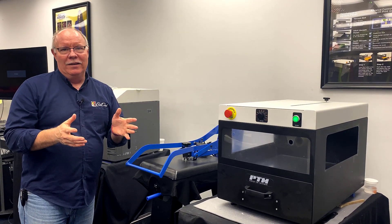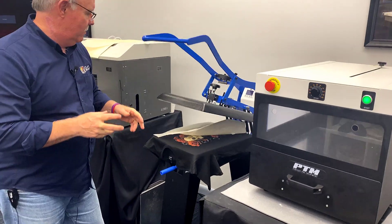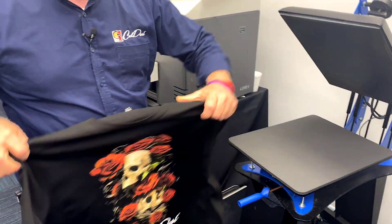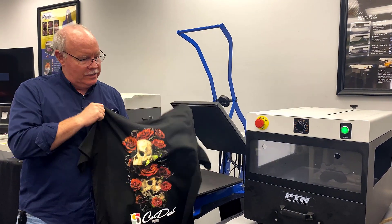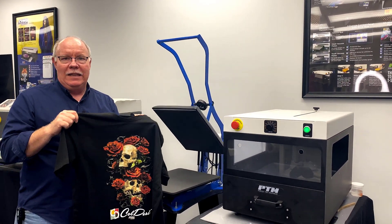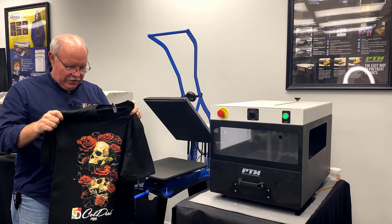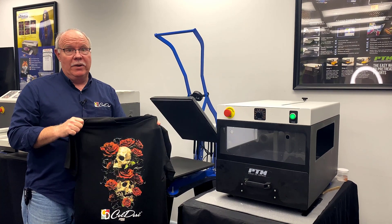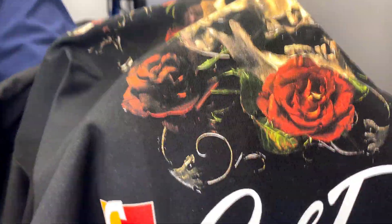DTG has come a long way in the last 16 years since it really became into vogue. We have some shirts we've printed off of this machine that have been washed 35 times and they still look 90-plus percent of what they look like coming off the machine. That's certainly a change with the ink set that we've used — we've actually worked to help develop this ink for the better part of the last 8 to 10 years. Washability is amazing. The color is amazing. If anybody has been around DTG for a while, that is ridiculous white — it almost looks like white vinyl.